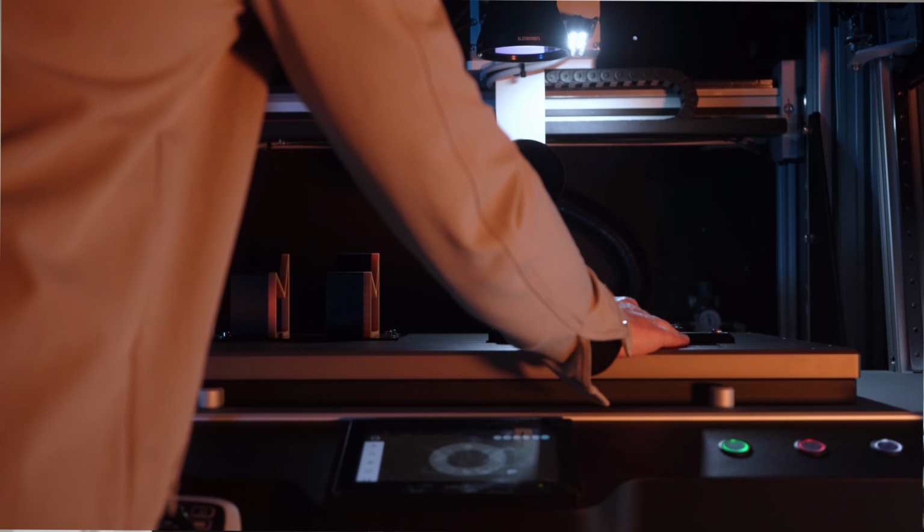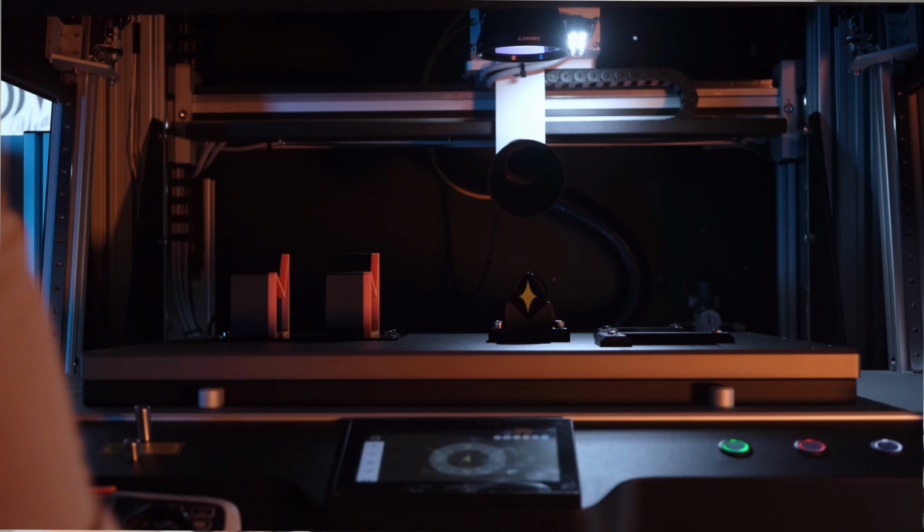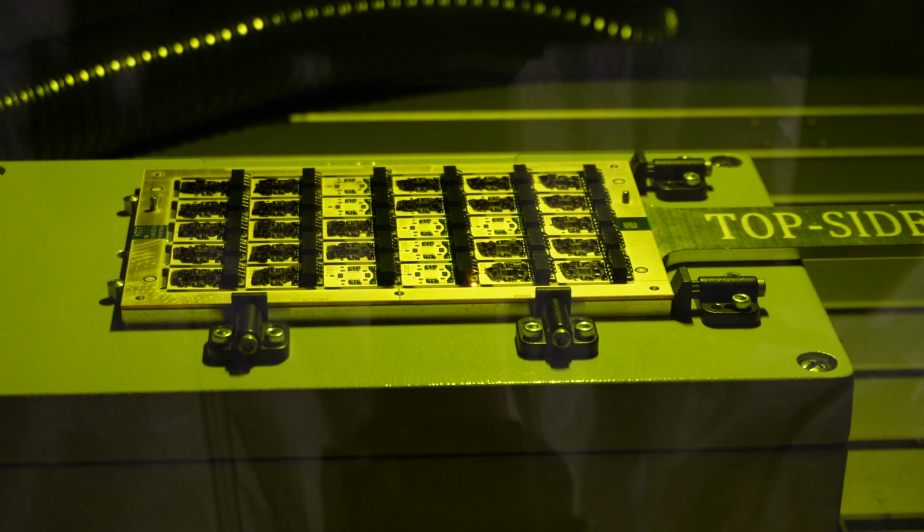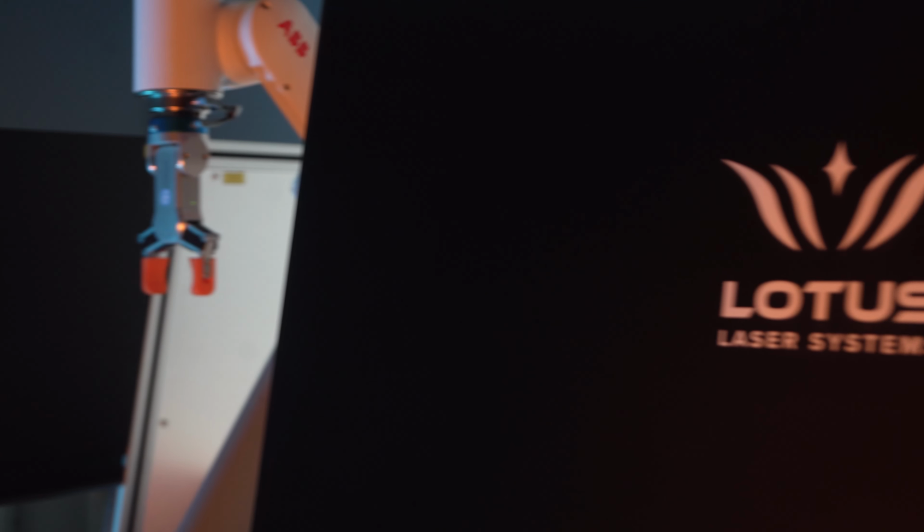Imagine that. Look at all the parts that you might need to do marking on. Load them into the machine. They're all done. Like our MAC setup, each one can have its own fixture. You can have one part that's 500 millimeters wide and one part that's 5 millimeters wide, and the XY will still run them as one job. Some of our customers actually split the bed in half and use one half for marking and one half for cutting, streamlining a production that should take 2 laser machines into one laser solution.